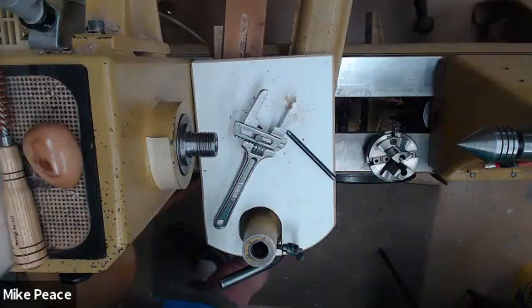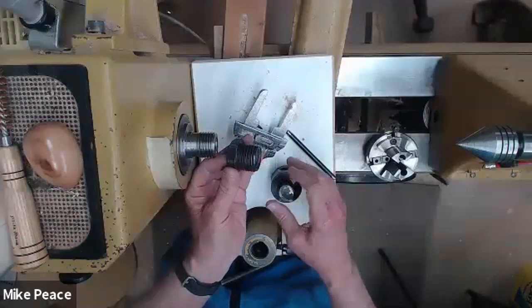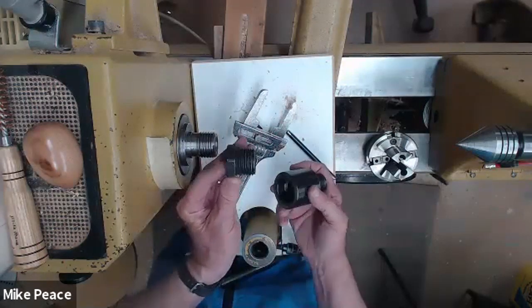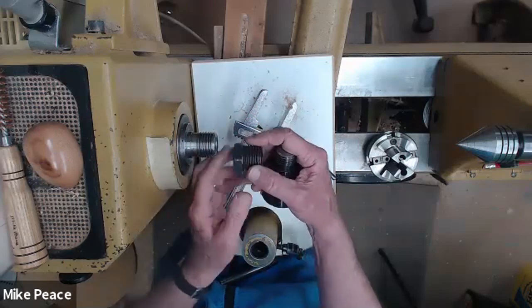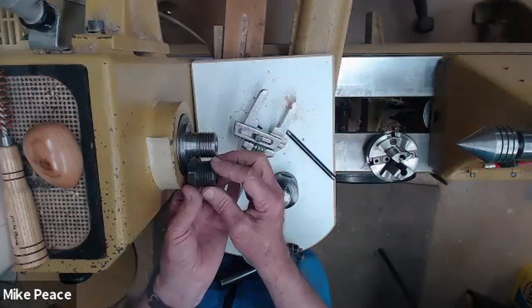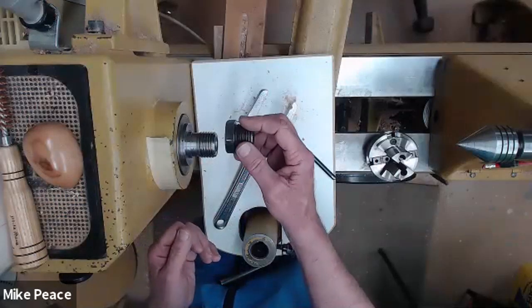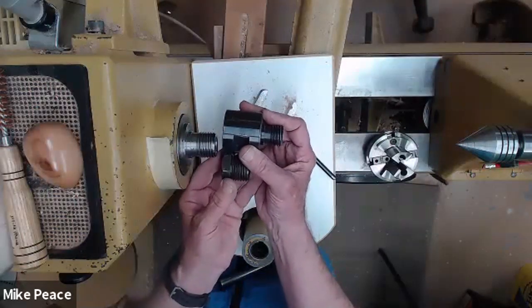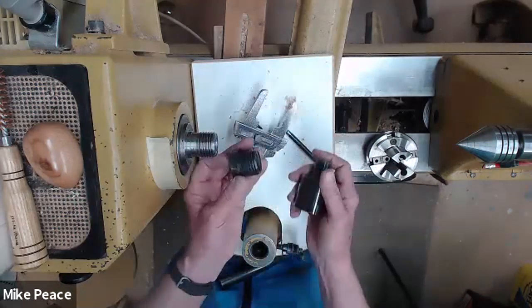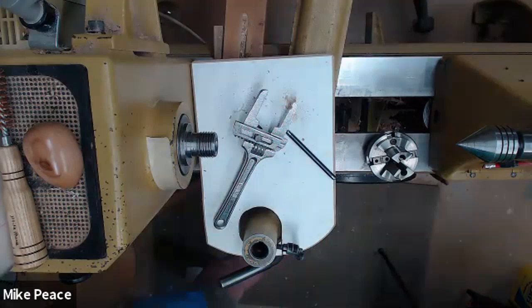Now, you've got spindle adapters that go from one side to another, and depending on what size you're going for, you might have this adapter insert, and this is better than this, but this is to go in the other direction. This goes from a 1-inch to a 1 1/4, so they can make it thin because it doesn't extend out very far from the lathe. And the further out you go, the more any error in manufacturing is going to present a problem. So this one theoretically has less potential for run out, except this was made by Pyromatic and this is made in China for PSI or Craft Supply. But this has been a real handy thing to carry in my toolbox when I go on demos and I need to use a different chuck.